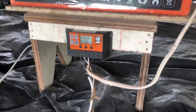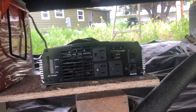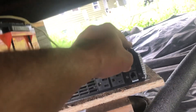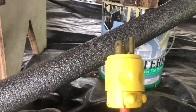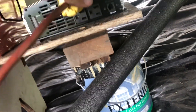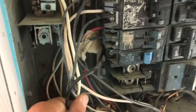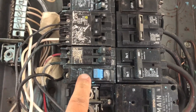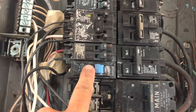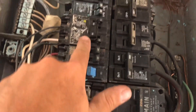Okay, I got it all done. The battery is hooked from the charge controller to the battery, and from the battery to the inverter. I'll show you what I'm going to hook into the electrical panel — this is how I did it with the generator and it worked fine just for the 110 stuff. Here at the electrical panel, I have the extension cord coming up through the conduit and into this breaker, so it's really only going to work on this breaker and this breaker.